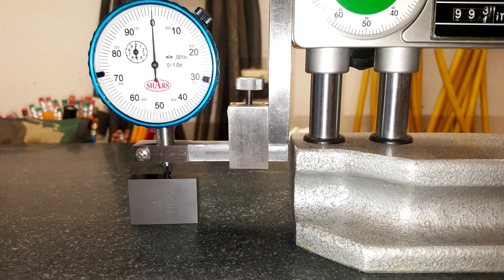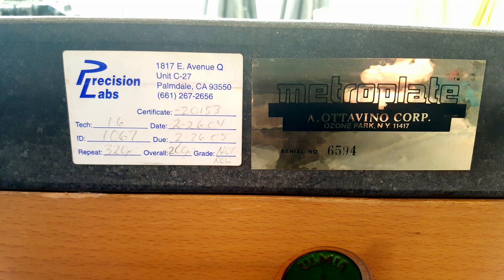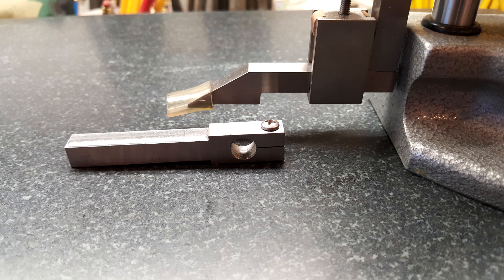I was never attempting rigorous testing, only rough estimates of accuracy. The Shars thousandth indicators were actually tested several times because during the original data collection I wasn't recording video, so I had to do a reshoot and remeasurement. I also recheck zero on the indicator before every new height test. Fifth: my surface plate is only Grade B and was tested flat to better than 200 millionths of an inch (two ten-thousandths). I was careful not to move the height gauge between tests so each test would be in the same place on the surface plate.